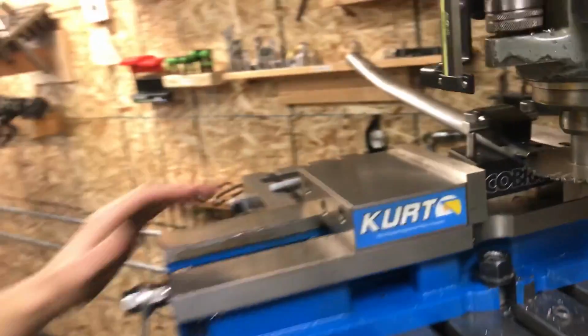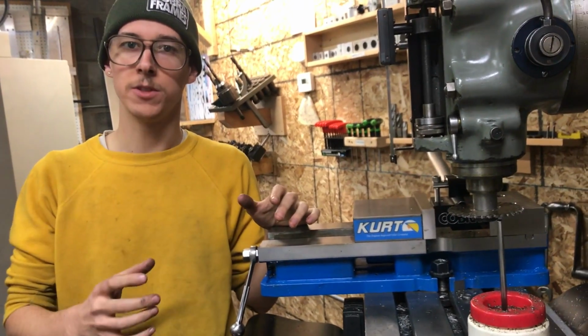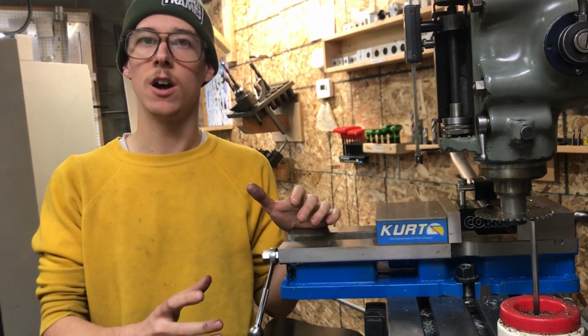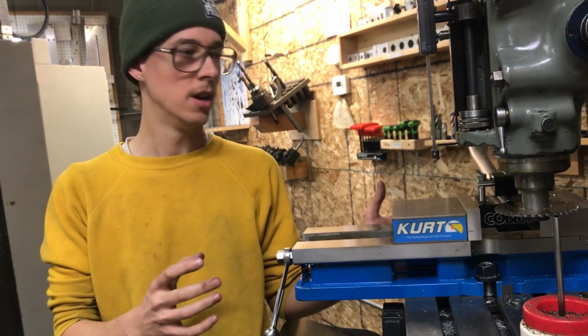Now you could notice during that cut that the cutter is actually eccentric. It's not totally concentric, and some of the teeth do the bulk of the cutting. That's a fact of life with slitting saws. Even good ones, on good arbors, with a machine with a great spindle, are going to do that, and you will always hear that to one extent or another with slitting saws.